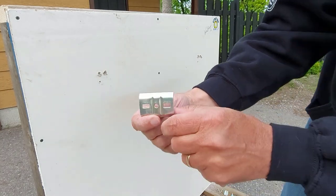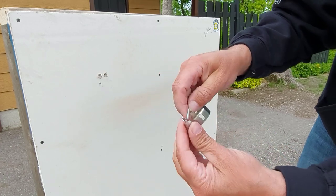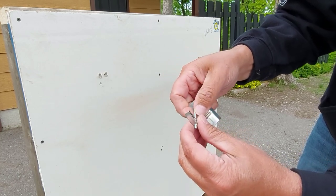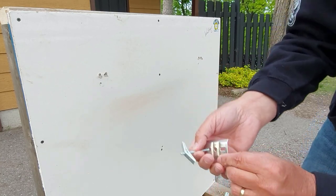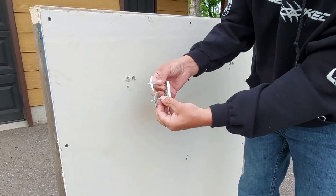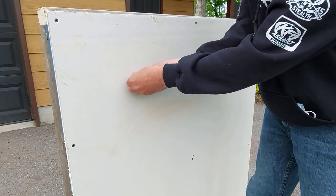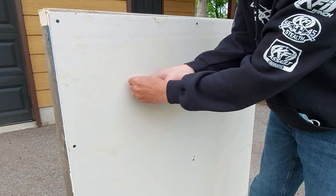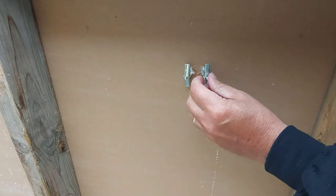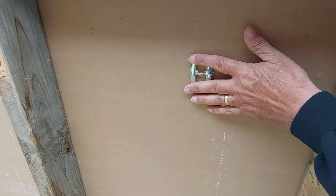Now we're going to grab our brackets and run the bolt through each one — through this hole and this hole here — then put it into the end of this spring-loaded mechanism, just partway through for now. I'm going to get this one in and get the others in too. Now that our toggle bolts are in place, we're going to run them through like this — just squeeze and push them through, and you can hear them spring open on the other side. Here's what it looks like on the other side: when you tighten the bolts, these will grab like this — you can see how that's never going to come loose.